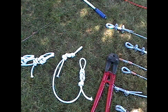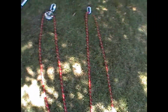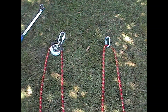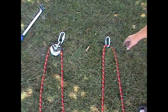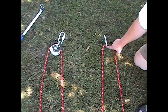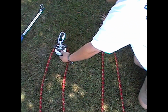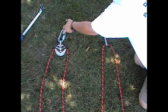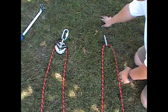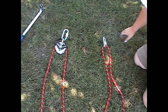And then the final two pull tests we're going to do will be on dynamic rope, 11 millimeter by Sterling. We want to do a pull test between a rapid link, simulating the top point of attachment for a belay with a 12 millimeter thickness or width here at the radial bend, versus a shear reduction block. This is the Stargate by Robertson. On a rapid link, just to hold the pull, but we want to take the rope and pull it straight down, representing complete 180 degree bend on each surface, and compare the two breaking points.